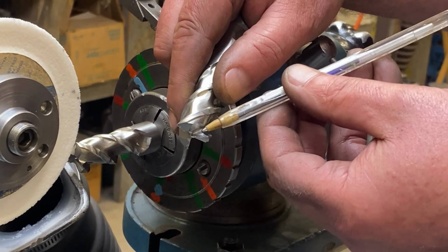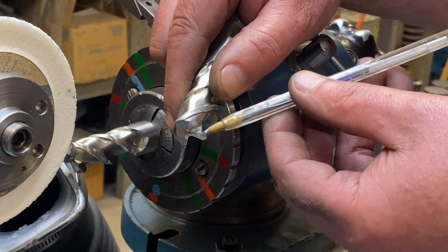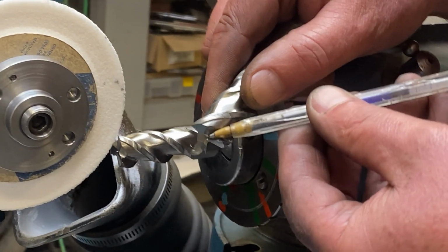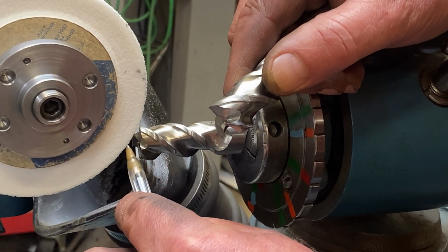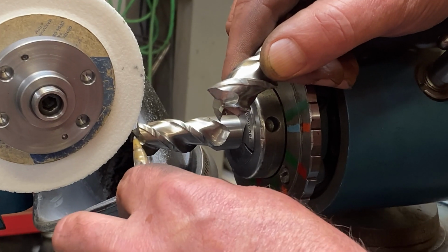You can see the back of this, the bottom, I guess, the back of this cutaway, this tooth here is on an angle about like, I don't know, 40 degrees or something. And so we're achieving that by having the grinding wheel off center. So this notch will be way deeper near the outside than it is near the inside.